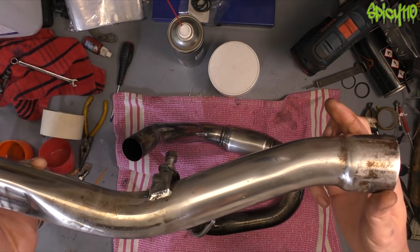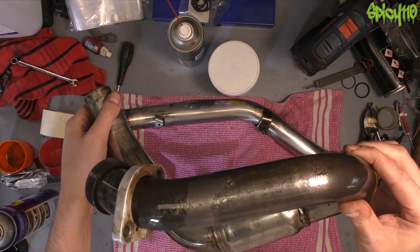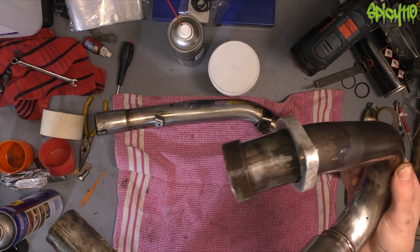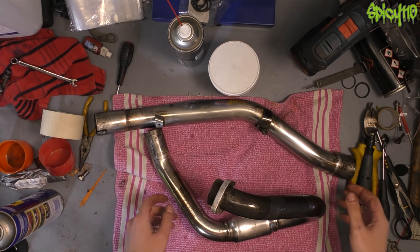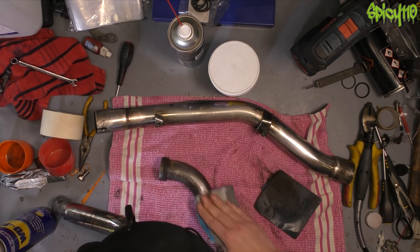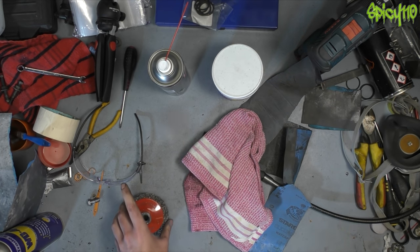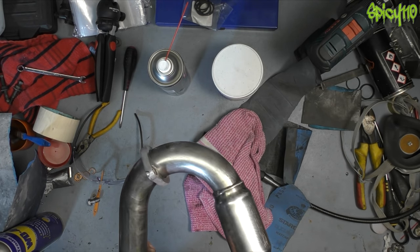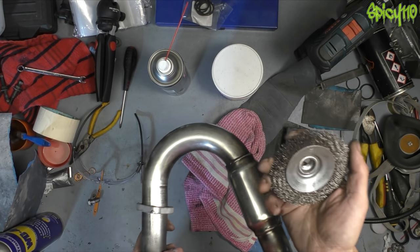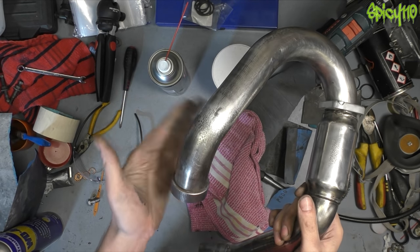These have been thoroughly rinsed and as you can see, with just a scouring pad and the phosphoric acid I've got the majority of that off. This one is clean stainless — there's no rust on there, maybe a little bit at one end, but it's not fully polished yet. All I'm going to do is go over it with a light wet and dry just to buff the surface up, and then go over the buffing wheel with a bit of compound just to get it shiny-ish. I've just done something with these pipes that I wouldn't advise anyone to do — I used a wire wheel on an angle grinder very carefully, not edge on. I've used these enough now that I'm pretty good with them, and if you go over the surface this way as long as you don't go deep you won't make any deep scratches. I've now cleaned up this pipe.